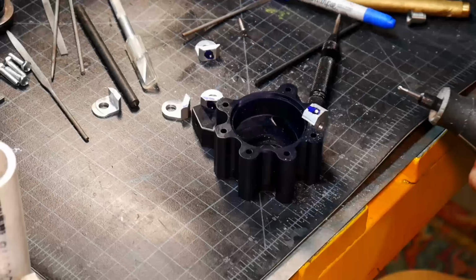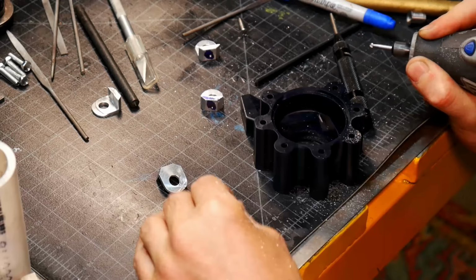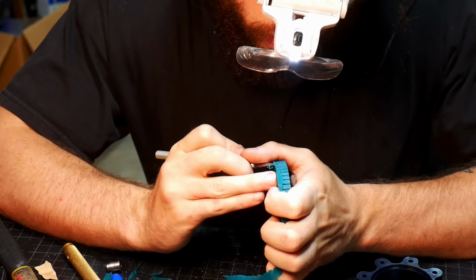And then there's a screw that drives it, and so I'm putting a little dimple in that so that screw doesn't wander off. And then the screw I sharpen to a point so it sticks in that dimple. And that worked well. Keep everything from twisting and moving around. The final version is machined. It's a tighter fit, so that's less necessary. But on this, it was good to keep things from moving around.